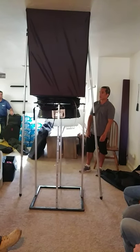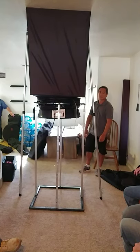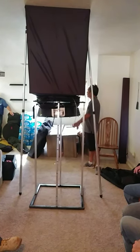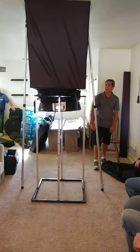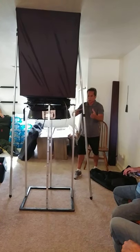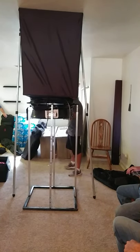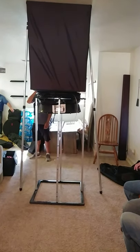That's why this has to stand freely while you turn the rheostat, read the manometer, and do the test as a single person. It was very important that we made it single-person so you don't need to send two raters out to do a whole house fan HERS test. This contraption had to have its own standalone stable stand that wouldn't injure anybody or fall onto brand new flooring or damage furniture or new walls. We even tried single-pole designs that relied on cantilever tension, but any pressure and vibration on this — if it's uneven — creates a gyroscopic effect. The blower door wants to move, and with only two or three legs it wants to tip if it's not level.